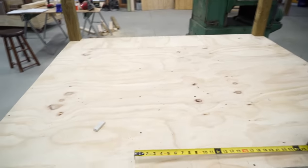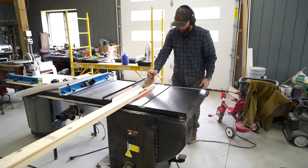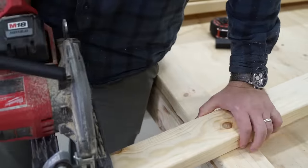You can use a circular saw and make that work too. Using my table saw I'll cut the angle for the top plate and then cut all my studs to length, and just work my way around cutting and assembling the wall frames as I go.